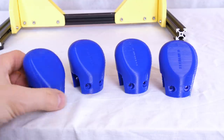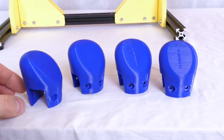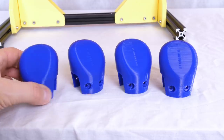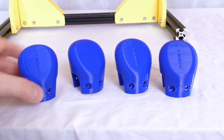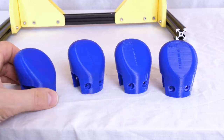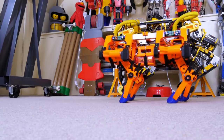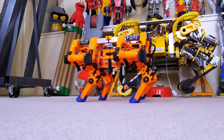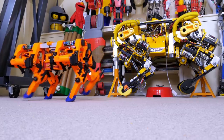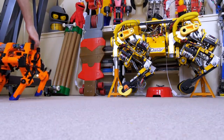It's foot profile number three, which is the same sort of shape with that toe but it's smooth so it doesn't get stuck in the ground so easily. These are actually just PLA — not Ninjaflex anymore — because it's much cheaper and much quicker to print. Hopefully it's really easy to see what I was talking about when I said the feet were sticking in the ground as they were pushing forwards. Now you can see they're actually slipping forwards as a result of the smooth feet, so I was right about that. It's pretty repeatable but it does look a bit like it's moonwalking — just turn it around and send it back the other way.